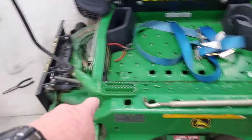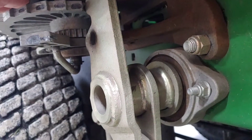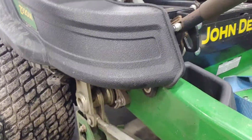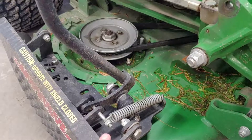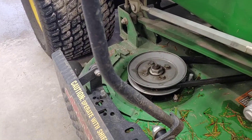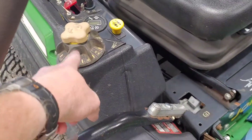What this is — I'm going to turn the camera around and show you the part and then show you the problem. So this is the rod that connects the deck assist pedal to the bracket right here, to release and be able to lower the deck and obviously raise the deck up and lock it back in place. I noticed yesterday that the deck seemed a little harder to get to release when the pedal was pushed down — it was pushing basically all the way as far as it would push in order to release the deck with this knob.